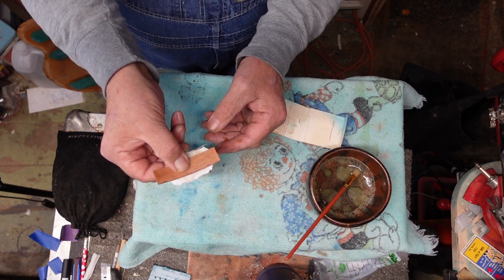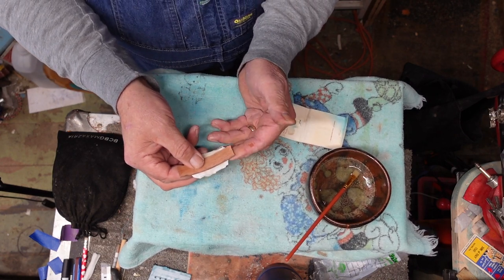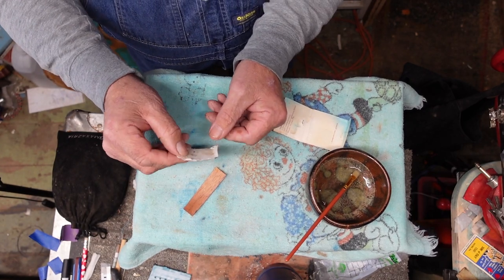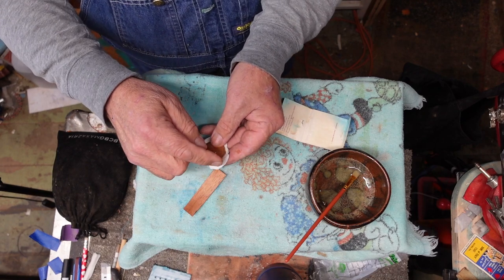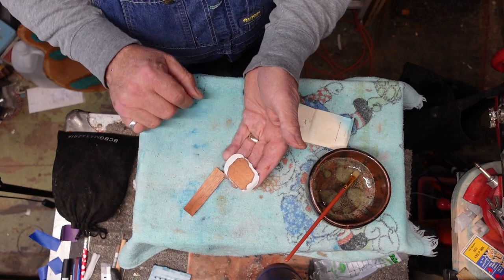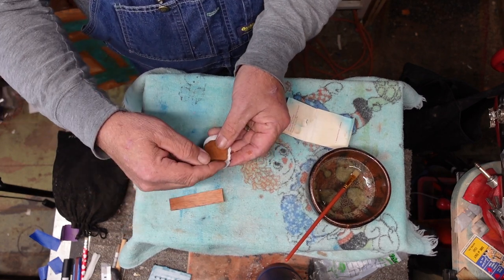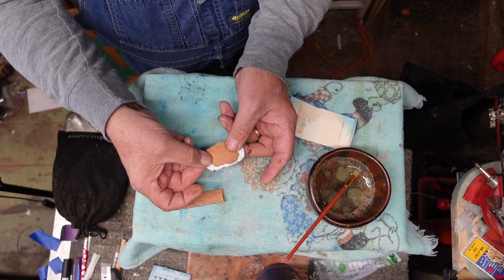that will fit the patch there and attach to the side of the body of the guitar around where this hole is. But I want to get this on here, and I want glue to be down in here holding this. I don't want a bunch of glue up on top here because that's where the finish is going to go. You don't want glue where you're going to have finish. So we're going to kind of keep the glue inside here, and then we're going to set this in first.